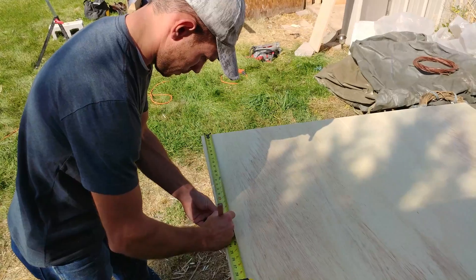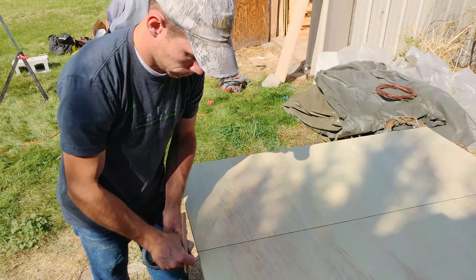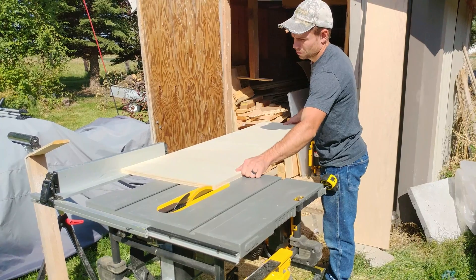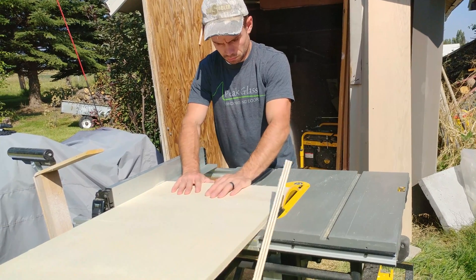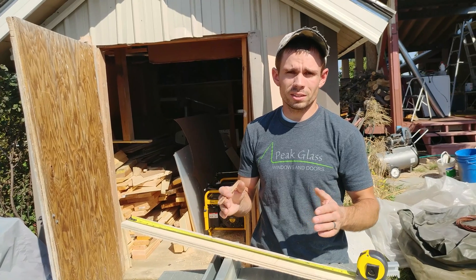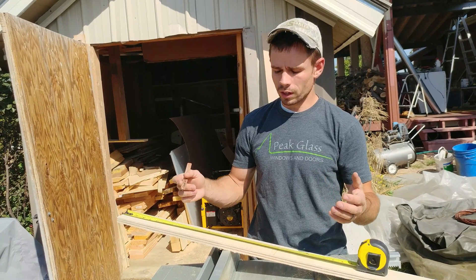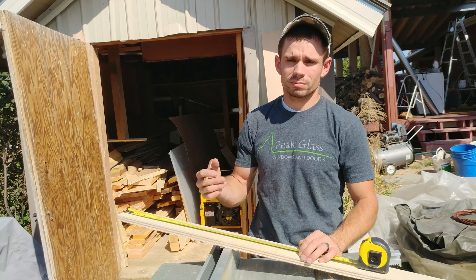The plans tell you to have your workspace at least 20 by 48 inches. One thing to consider if you're doing this by yourself, especially without the ideal workspace, is to mark your piece a quarter inch over, do a rough cut with the circular saw, then take it to the table saw for a precise cut. The instructions aren't really clear on the length of the fence or the backing block, but based on the picture it looks about halfway through the workspace — so I'm cutting my fence at 12 inches and my backing block at about 8 inches.